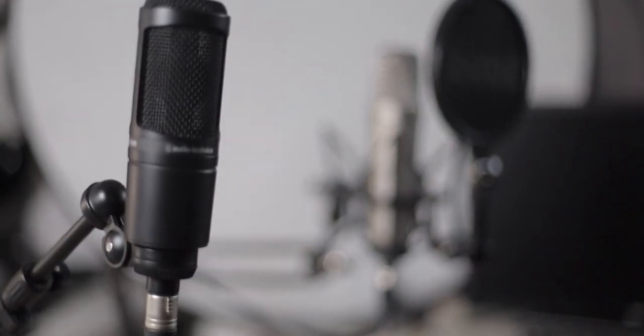So the frequency response of this microphone is a little smaller than the other K678, and it is going from 50 Hz to 17 kHz. Which is going to be less than a Rode NT1A or my AT2020 or the other FIFINE microphone, which went from 40 to 20 kHz, I believe. But the range is actually still more than an SM58, so it's totally fine for basic vocal work. You just don't have quite as much detail above 17K, which most adults can't even hear. And most of the time we cut out everything under 100 Hz because that's all low-end rumble and handling noise and stuff. So yeah, 50 to 17 kHz is actually totally perfect for the voice.